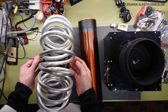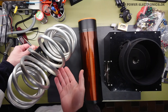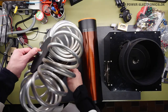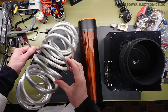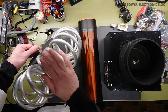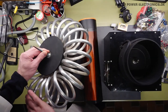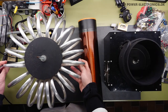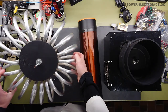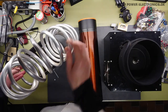Now this is what you could call a vertical two-pin top load. Normally a ringed top load would be a horizontal band of maybe 5 to 7 tubes, and that makes a very even field for the electromagnetic field shaping. So when you do this vertical type, it is important that you do not use too few windings. If you left out these two and you only had this and this, this gap in the field shaping would simply become too great that you would have all kinds of random breakout because it just did not assemble an even field. So I would say that this is made with enough windings to actually, when seen in a simulation of electromagnetic properties, get up along the lines of the same capacitance as a full toroid, just as much as a ringed toroid would do that were horizontal.